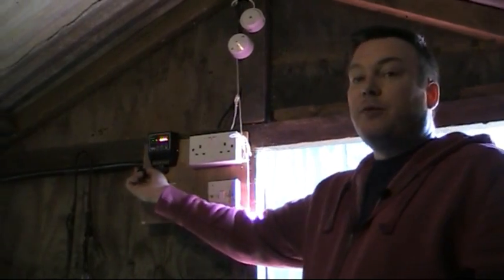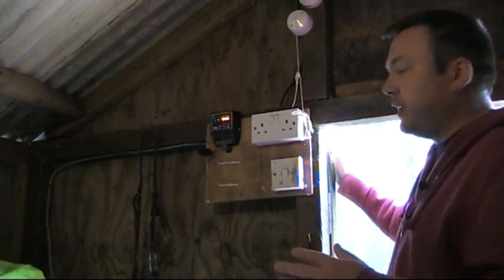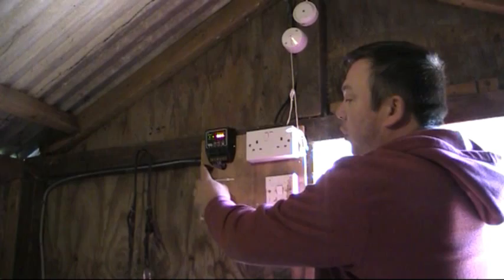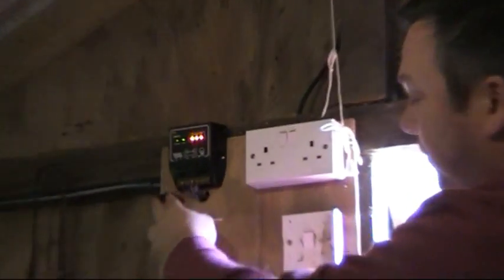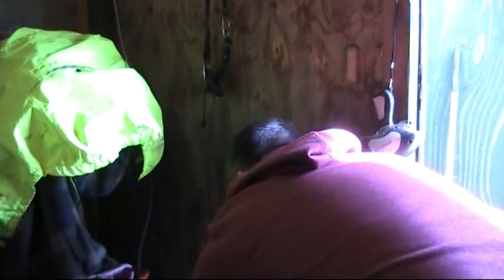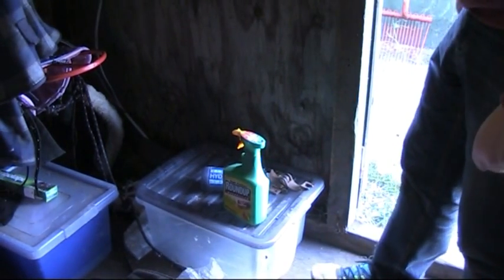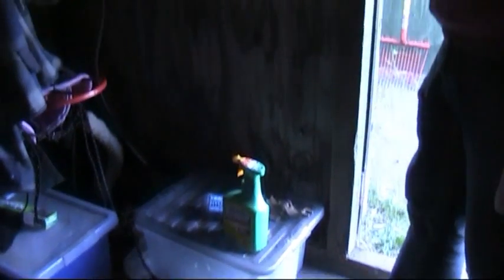This sticking out here is just the fuse, because inside this barn I don't want any risk — no fires, no shocks, no problems — so we've got everything fused correctly. That goes straight to the battery; that's just a 10 amp fuse in there. Everything's fused all the way down, even the battery itself has a separate fuse. And when we're not using the battery, we've just got a lid that sits on, just to stop anything falling on top of the terminals and shorting it out. When we're finished, that switch completely isolates the whole lot.